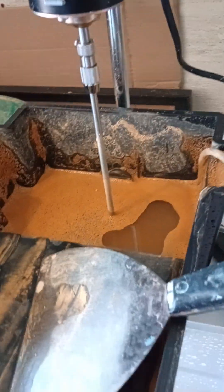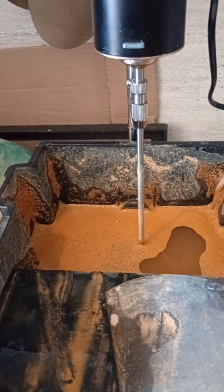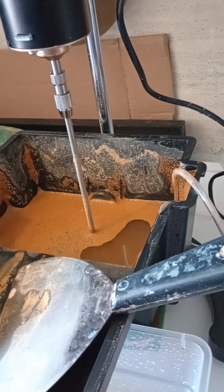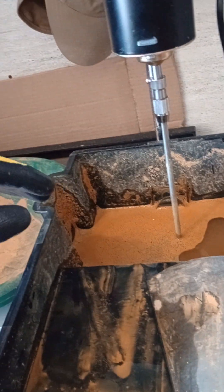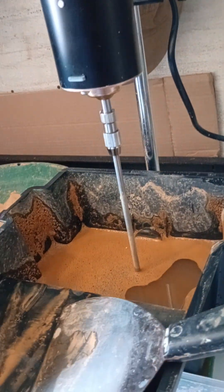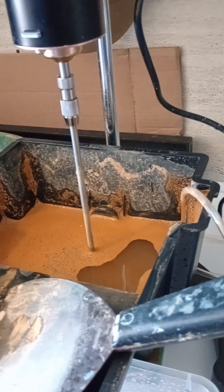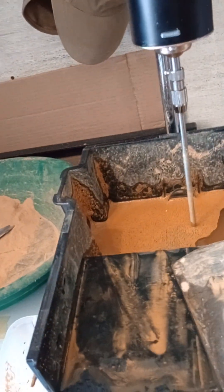What I'm coming to understand is that when we're coating these little metal particles in this pine oil — which is also a carbon compound — instead of trying to fuse carbon compounds with sulfide minerals using heat, you can coat carbon compounds around the sulfide minerals using this flotation method. Then you scoop it all out and it's coated and ready to be reduced when you go to do your smelt. So it's like a double bonus feature doing this flotation.